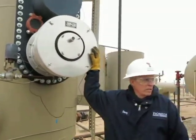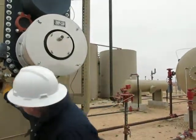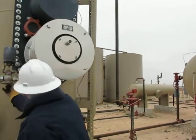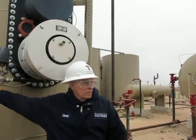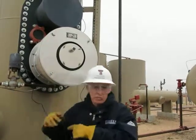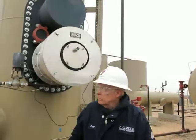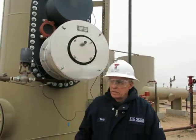This is a thermocouple. And the thermocouple regulates how much gas opens up to go into the burner, which is located right here. What's that small pipe in the back with the other valve? This right here? Yeah. That's taking the gas to a pilot, in this particular one, that leaves a small flame burning all the time. So when this kicks it on, it'll start it up. The burner is only turned on when you're actually needing to heat up, but the pilot's always on.